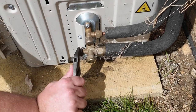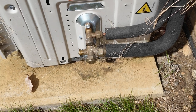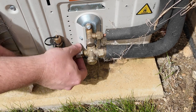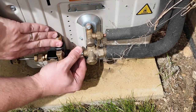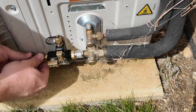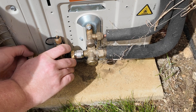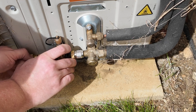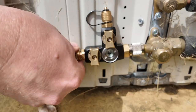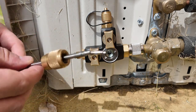Using a spanner I can take the service cap off the system and now I can connect the VCRT. There's no need to use a spanner to tighten it — finger tight is perfectly fine. I can then depress the capture rod and start spinning it anticlockwise whilst taking a firm grip of the tool. This removes the valve core inside the system, and once it's completely out I can withdraw the capture rod and verify I've got the core through the sight glass. I then close the ball valve, remove the capture rod and core, and use the magnetic cap to secure it so I don't lose it.